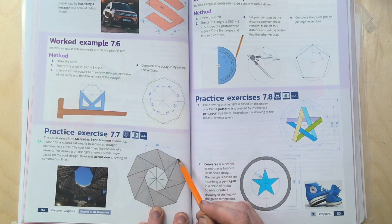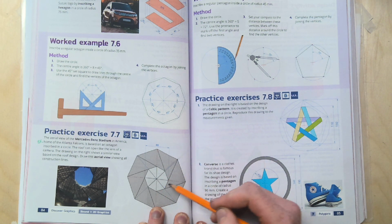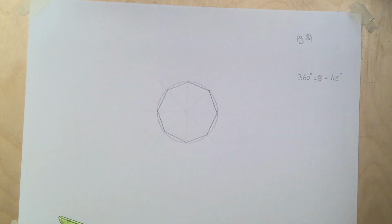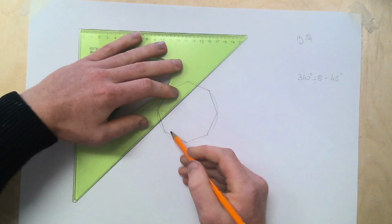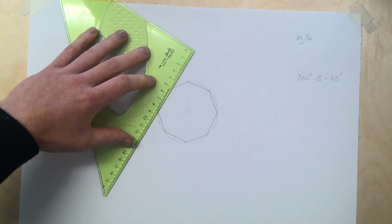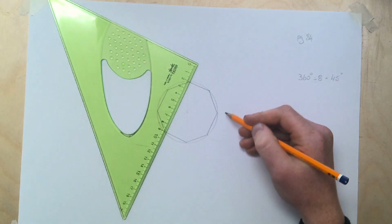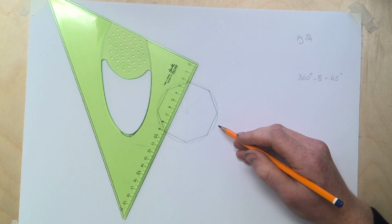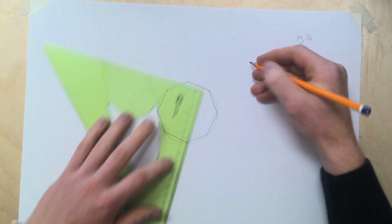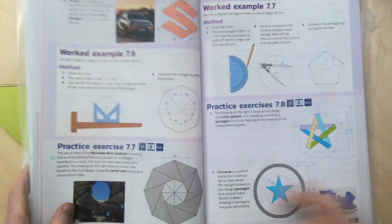So for example, this first corner here, right? I'm going to carry this line out here that I have at 45, extend it straight on, and extend the side straight up till I find this first corner. And I'm going to work all my way around and finish the shape. So this 45 degree line gets continued on up. Let's continue that up. And then my line on the side here, right on the corner, is extended up to meet it. So that's the first point.